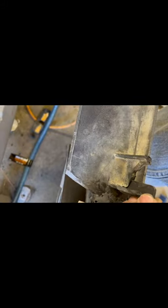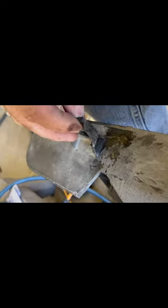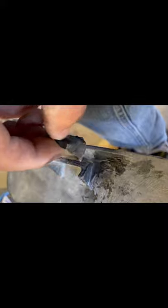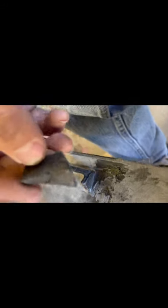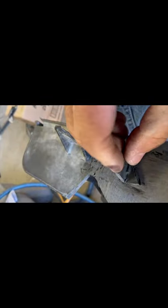This little piece was flat. I got it warm on both sides and basically I'm gonna put it like that with that little edge on it and trim it up once it gets in there. It should look halfway decent. See how I got that little angle from a flat piece instead of having to cut it and reweld it together? I just got it warm, used my pliers and pushed it on the concrete like that, held it until it cooled off a little bit to hold the shape.